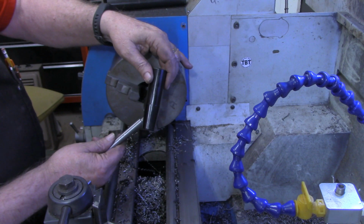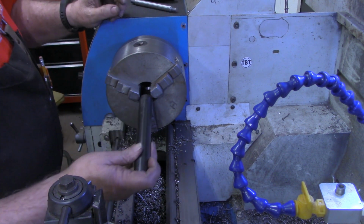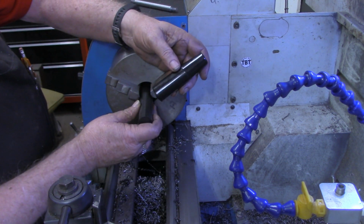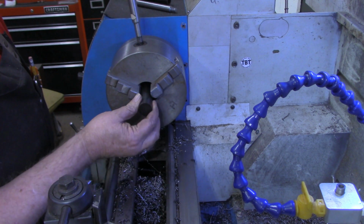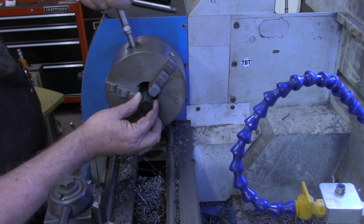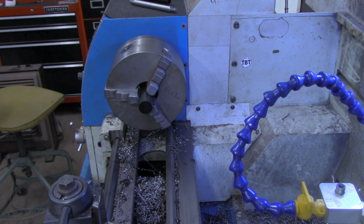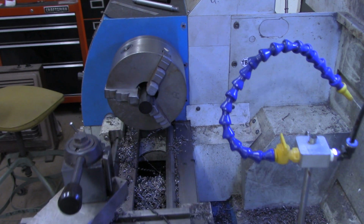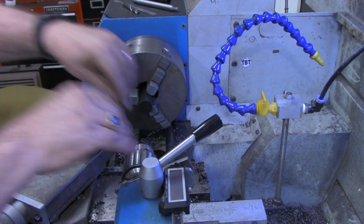This is the handle off of the right side. We're going to use this piece of Delrin to try to replicate that. This one's a 1.1 diameter, and this is only 1 inch, but I think that'll be plenty fine for what we're doing. This was a faced end right here. So what I need to do is drill about 1.9 inches, 1.85 inches with the tap drill for the 3/8-16. I believe I will go ahead and put a starter hole in.